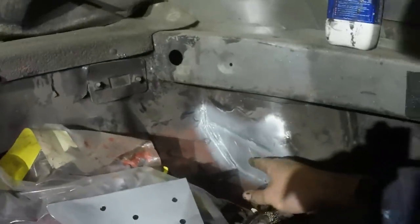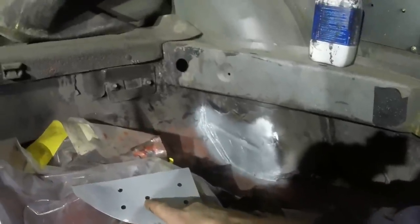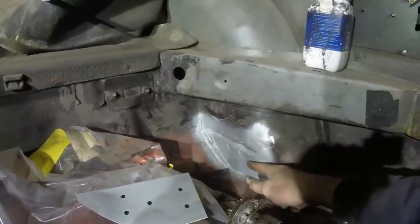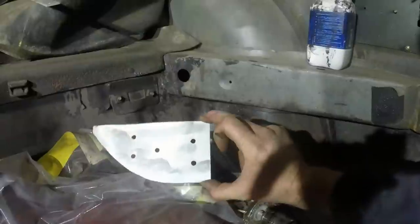This is speed welding fabrication. That is the patch. I've drilled big holes in this. These are like 7.5 mil because that has a thickness of about 2.5 or something stupid like that. And as I've laboured the point many times before, if I left them at like 5 mil, by the time I'd filled in the hole with a pool of weld, there would have been no heat penetration into that. And it just wouldn't have stuck, it would just ping apart.